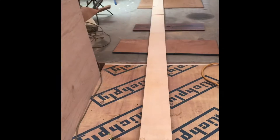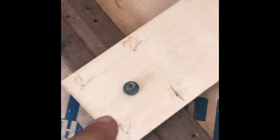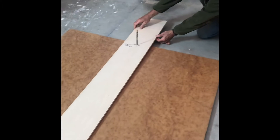Carl Bacchus, my genius friend, did the math. This is our 18-foot compass arm to get a 36-foot diameter, with the router going in — that's the pivot point. We're going to pivot on a bearing we put in the floor, and then out here are the inside and outside edges of the first piece of the Japanese low table.